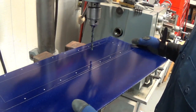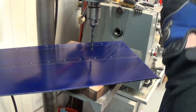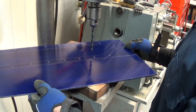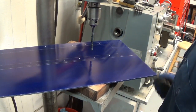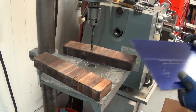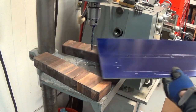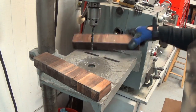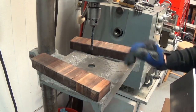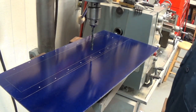The reason I like to drill on one big piece is so you can chuck the piece up against the column on the drill press. If the part's touching there and the drill grabs it, it's at least not going to come out and become a buzzsaw cutting you in half. The worst thing to do is drill out here and use yourself as the column. Also, always have a nice piece of hardwood underneath so you don't scratch up the back of your aluminum part while drilling the front side.